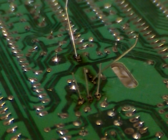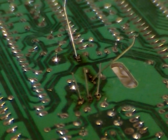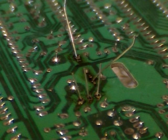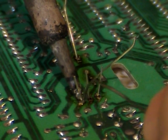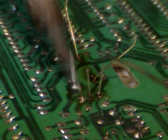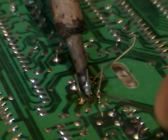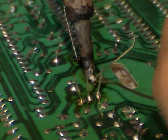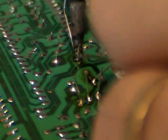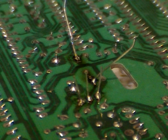Here I have the leads poked through. I've spread the R11 resistor leads out so it stays in and doesn't fall out. Then we take our solder. When you're soldering, you've got to make sure you don't use too much heat — just put enough heat on it so the solder flows. These boards are low-cost boards, that's why they tear up so easy. The copper tracks are pretty thin, plus they're not double-sided, which would help make the parts stay in better.